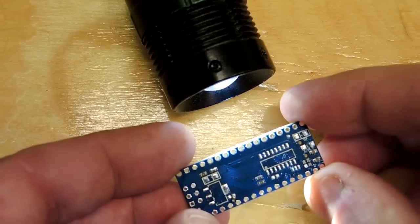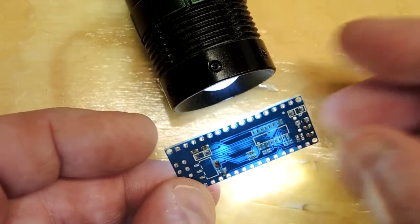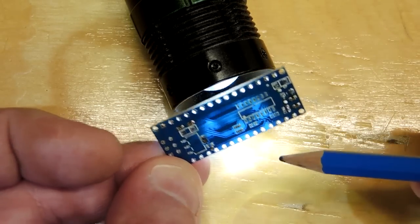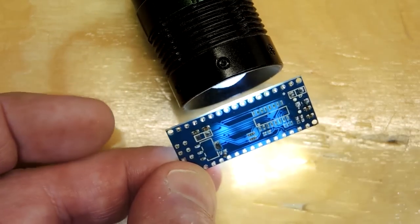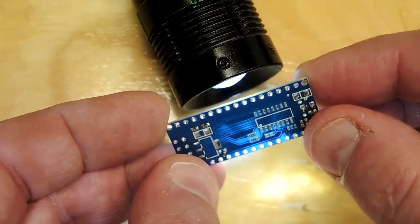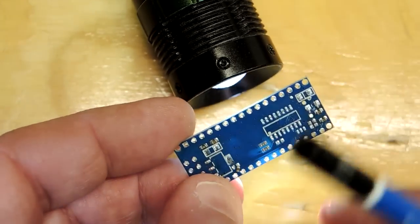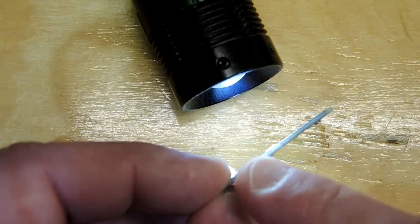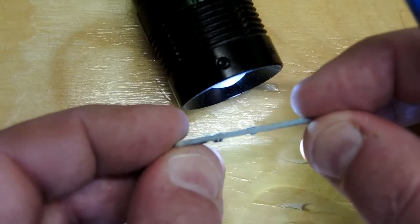What can you see from the circuit board from an engineering perspective? It's two layers, and that's not a surprise because that's in the published design files. But one quick way of checking is to use a bright light like a flashlight and see if you can shine light through it. If you can, it's a strong indication there are probably only two layers, otherwise you'd normally see contiguous metal layers which would hide the light. You can verify this by grinding the board down.